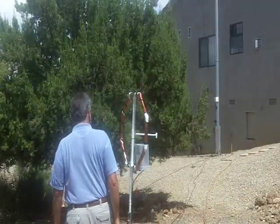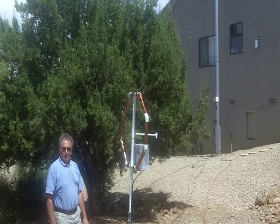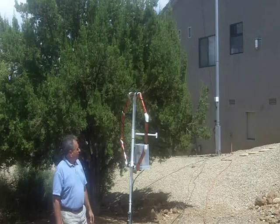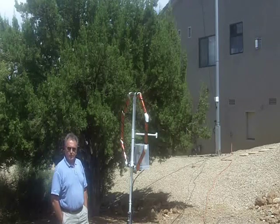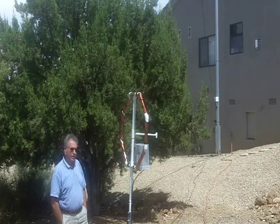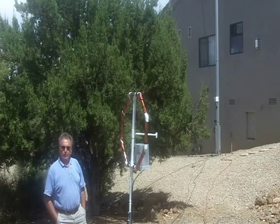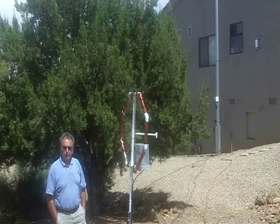On the way over to the 20 through 10 meter version of this antenna — basically the same design — this one's on a rotator, which really enhances operation. This antenna is only 33 inches in diameter in this octagonal shape. It employs the same type of tuning system with a high voltage capacitor and a remote controlled motor system, which I'm going to change to a stepper motor shortly. You can see the actual copper foil design as it hasn't been painted yet for protection. Photos of the other one before it was painted are also available.